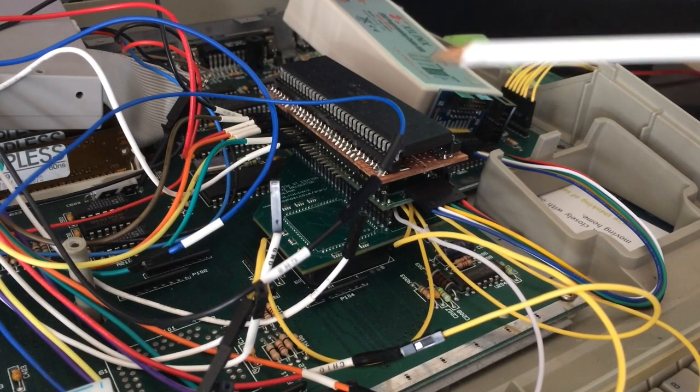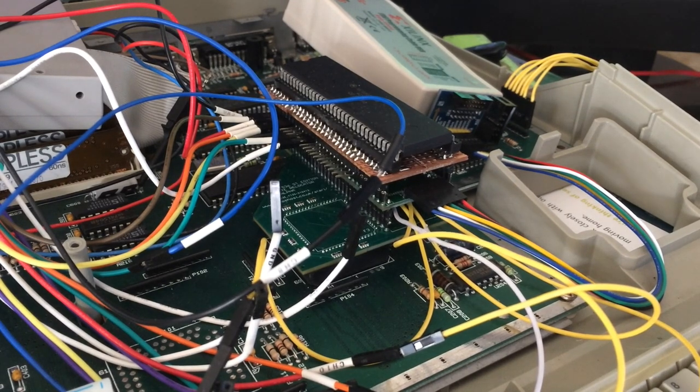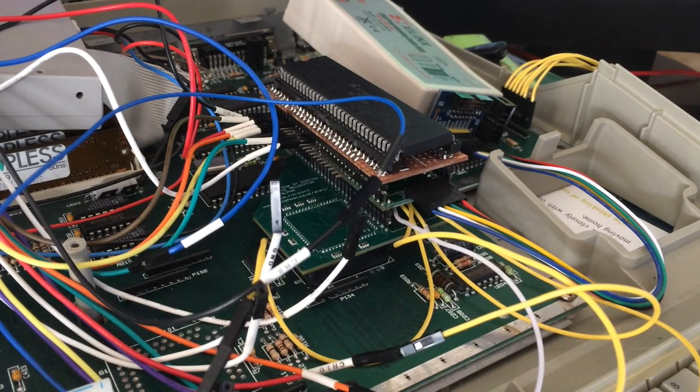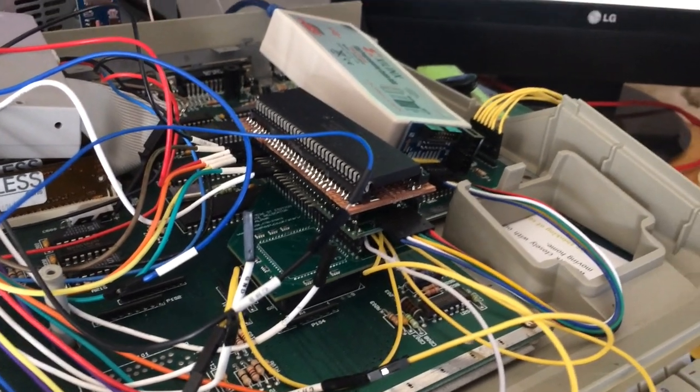16P 68000 processor. Now, a little bit of jiggery-pokery on the firmware, but nothing too particularly clever. Oh, and there's a whole load of test leads just soldered onto the side here so I can monitor things. And this scramble of wires here is actually my logic analyzer. But there's nothing too smart going on in the firmware, just the clock switching routine that we saw before. And I've added my SDRAM, adapted from the controller from the DFB1, which is in turn based on Stephen Leary's Terrible Fire 330 controller. And all that sort of just wedged together there with no particular ceremony, and here we are. This is what we've ended up with.